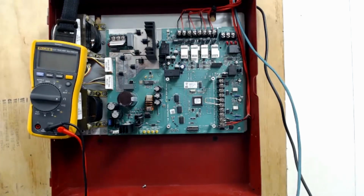By using the addressable control modules, we still get all the supervision possibilities, but now it adds the ability to describe where it is, just like we can describe where a smoke detector is. So we can say closet in classroom 232, power supply trouble. And then you go straight to classroom 232 and you look in the closet and oh, look, there's the power supply that's in trouble. And you saved a whole bunch of time and headache trying to find this power supply.